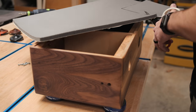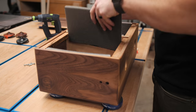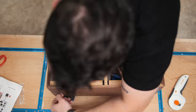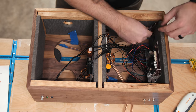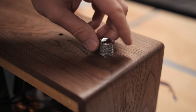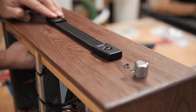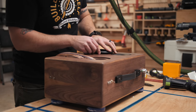Once the finish dried, I could get to final assembly. I added half-inch sound-damping foam to all the inside faces of the cabinet except for the front baffle — it has a peel-and-stick backing, so I just cut it to size with scissors, making sure to cut around any of the holes I had drilled. I mounted the crossovers and amp board to the center divider with screws, and used a round rasp to cut a groove in the divider to allow cables to pass from one side of the cabinet to the other. Finally, I installed all the switches, LEDs, rubber feet, handle, and ports, attached the back panel, dropped in the speakers, and the boombox was finished.